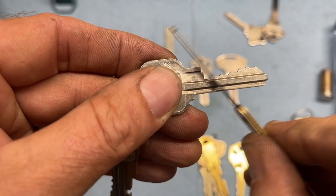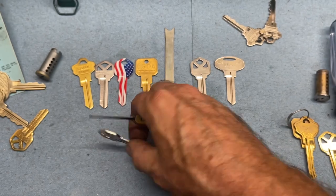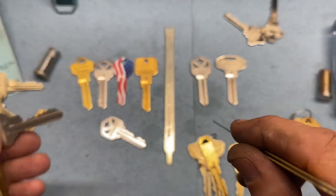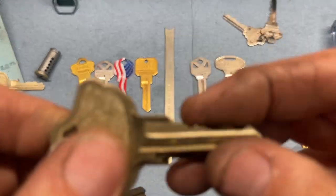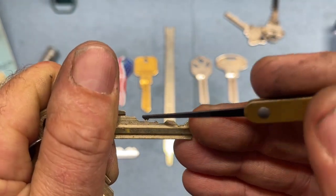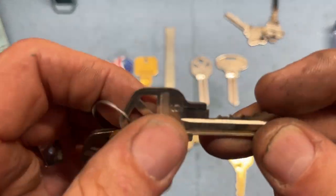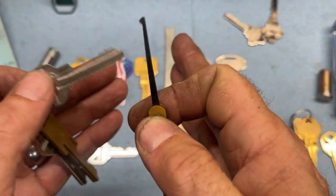On almost all locks, this is one way you can for sure tell, besides the number 6. If you look at a regular Kwikset key, it's 5 pins, or 6 pins, but again, it's squeezed up in the front. And if the cut is past 2, if we go over to this Titan, for instance, if you glance at this key and don't look at the head, 1, 2, 3, 4, 5, that's because this is a 1 cut. So that's a little trick to get past having to cut this vertical cut, because you do have to have a cutting machine, or you have to file it.